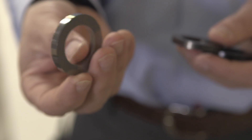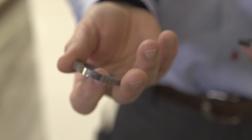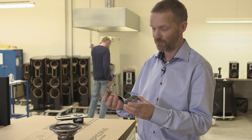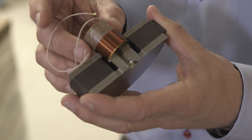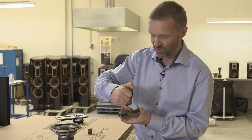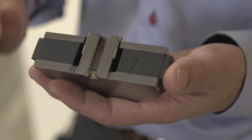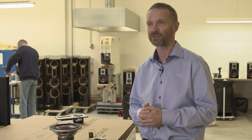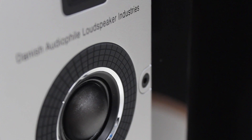It runs through a couple of processes, and when it comes out of the pressing tool, it looks like this. Then it goes to the next process, and so on — it's quite advanced machinery you need to do it. In a magnet system like this — this is a cut-through of a magnet system — here's the place where the voice coil is supposed to be. Some of the parts closest to the voice coil are replaced with parts made out of SMC. Does it do any good for the sound? Well, yes — we believe we can hear a clear difference, and we can actually measure a significant difference compared to a normal magnet system.